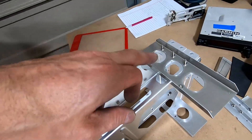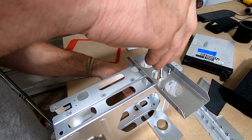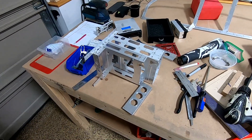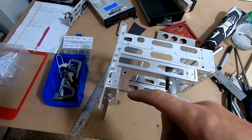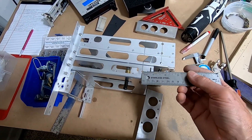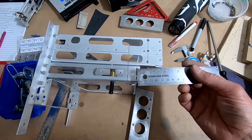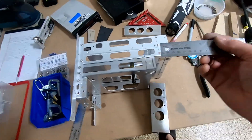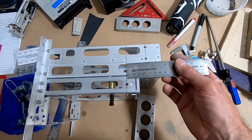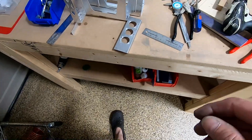With the fake lightning holes, if you go in through the side it at least allows you to get a screwdriver in and tighten those screws versus fighting through the inside. I can't recall if I've expressed any frustration with the accuracy of these Garmin mounting holes — when I first measured the distance from the comm unit to the 650 at the rear mounting holes, it looked like one and a half inches, so that's what I based all of this on. Wouldn't you know it: when I went to put it all together there was odd tension, and it turns out it's not one and a half inches — it's one and a half and a sixteenth, so nine-sixteenths. Time to re-engineer.